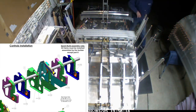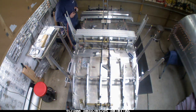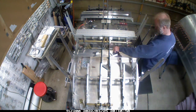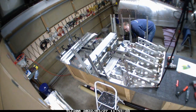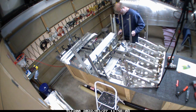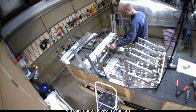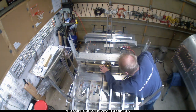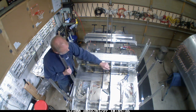I'm working on the control tubes here in the center fuselage. I've got the top control rod, which is for the flaps, and the lower one, which is for the elevator. This is a bit of a fiddle project — a lot more fiddling than I expected. You've got four points along each tube, upper and lower, and there's a bushing at each one of those points that the control rod rides in. You really want to make sure that each one of these points is super smooth and has no resistance. The problem is, once you put the mounting brackets in place, it can apply pressure to those bushings, which creates tension on the tube and causes alignment issues and binding in the bushing.